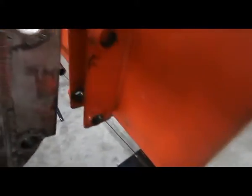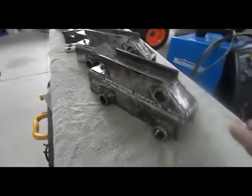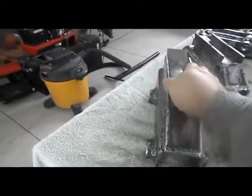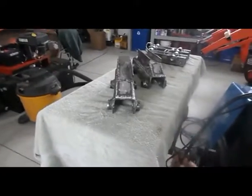By bending those little wings, like I said, if I'm off a little bit as I'm coming in, if those sides are bent a bit, it will help slide it in. So that's the plan there. The distance between this is pretty much dead on to the inside of the bucket, with a little bit of clearance, which once I paint it is going to be really close. But if I bend this whole line and this whole line inwards, it'll give me almost an extra half inch that I can play with as I come in.